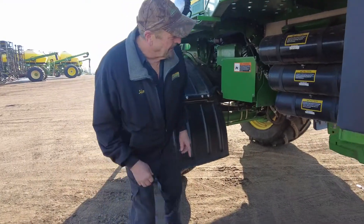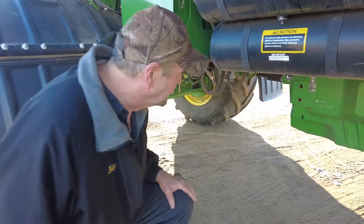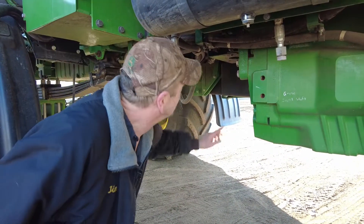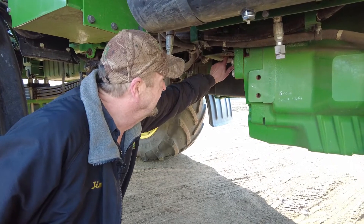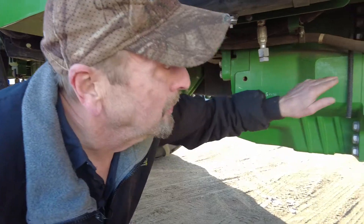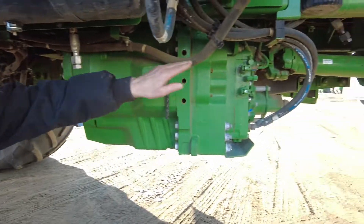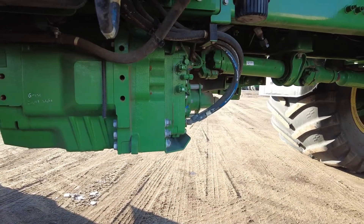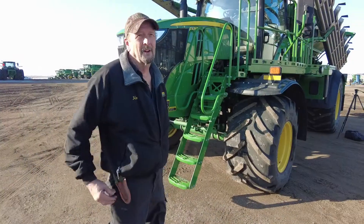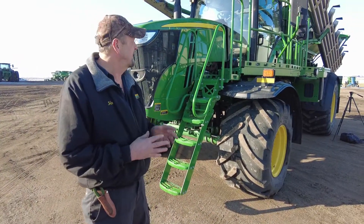As mentioned earlier, there is a gear case under here, and also a grease fitting straight up here that's kind of hidden — it needs to be greased every 100 hours or so. All the way along the drivetrain, any grease fitting found on the driveshaft should be lubricated.